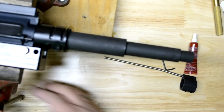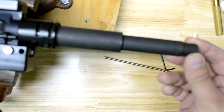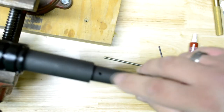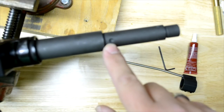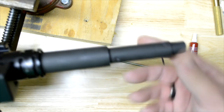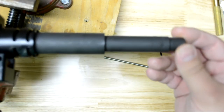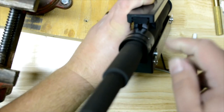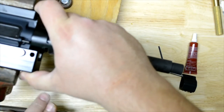On the barrel — this is a 7.5 inch pistol barrel from AR Stoner, it's a 1-in-8 twist. Here's your gas port hole on top of the barrel; it's already indexed with a little dimple on the bottom. That way we don't have to worry too much about aligning it perfectly, because once we start putting in that set screw it's going to wiggle right where it needs to be. I'll still spot check it by sighting down the barrel and where the gas tube goes inside — just make sure it's centered up in there as best I can get it, but it should be pretty darn close because of that dimple. So I'm going to put that back in my vise and away we go.